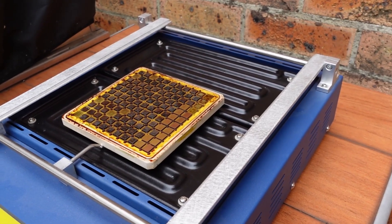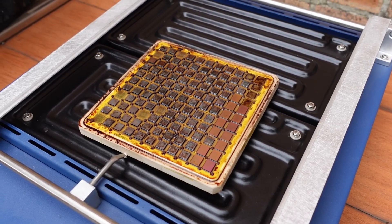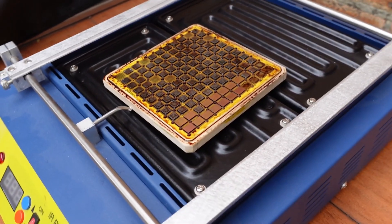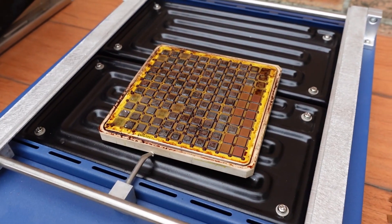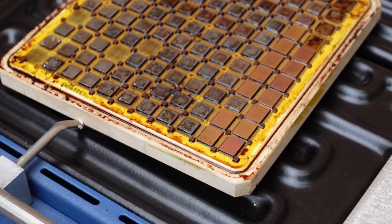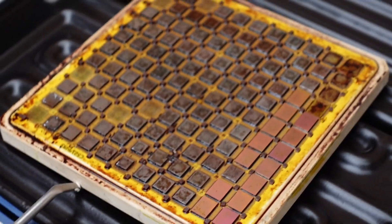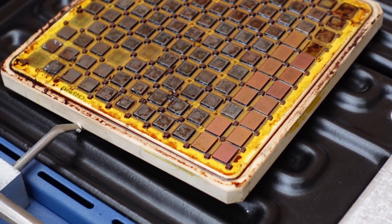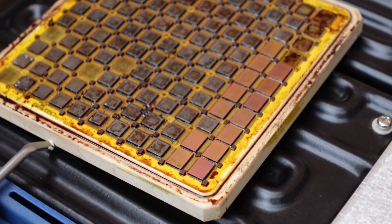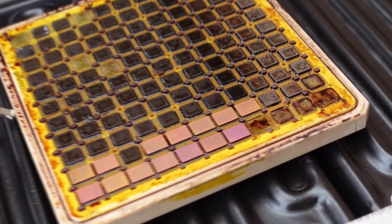That was like over 280°C, so I guess there's your melting point — roughly, depending on the emissivity and the IR meter. It's interesting how we couldn't do this with the preheater at 150 or whatever it was, plus the hot air gun on top. I've got to make sure I'm upwind. This is a 60-plus layer PCB and a huge ceramic substrate, and it's taken me probably a good hour to heat this thing up — to ramp it up. Absolutely incredible. It's getting radiant heat from the elements plus conduction through the metal pins at the bottom, all contributing to heating the whole thing up.